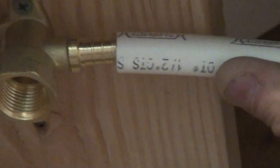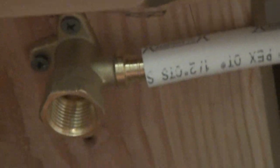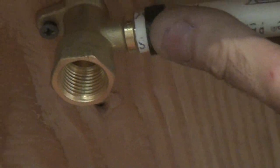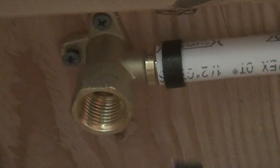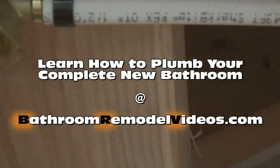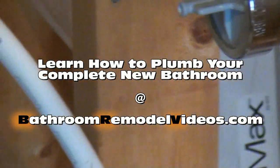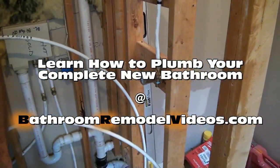Okay. All right, now up top here for our rain shower head. PEX on there. Get the crimp ring slid up there. Get your PEX tool on there. Leave that little 1/8 of an inch there. And crimp away. Okay. We are connected and done except for our hot and cold, which I need to kill the house water, and we need to get inline shut off.